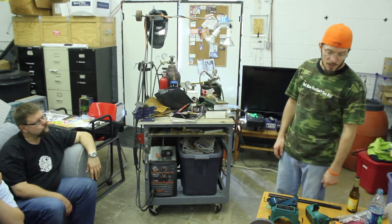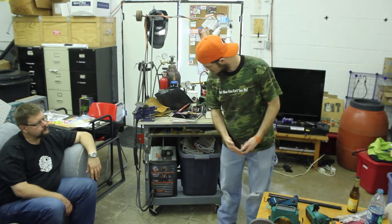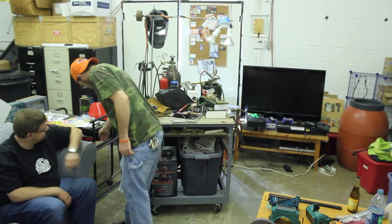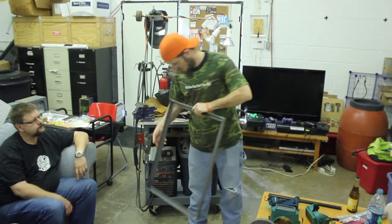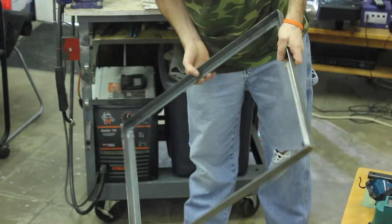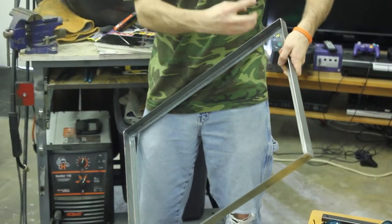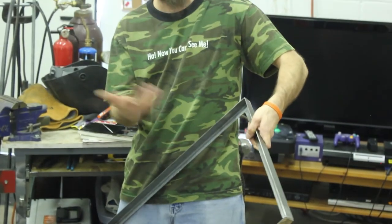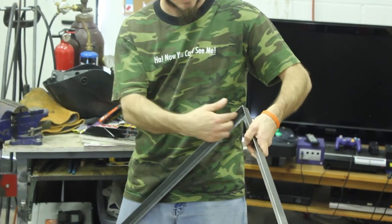And you'll find out about them pretty quick when you try to weld, say, two pieces of angle iron in a corner. I'm trying to think of a good example. I've got a good example on this. The outside is one thing. When you go to cut the corner, you'll see that you're putting that tip in there, and it just gets hot, and that tip is trying to melt things. The tip is as hot as the welding itself, yeah. And you're worried about the tip failing, blowing up, exploding, and cracking apart. And that's where I get a lot of my pops from, is welding inside corners.